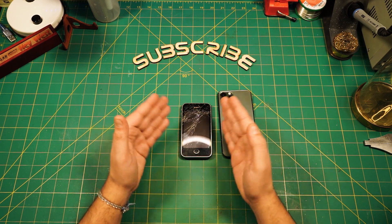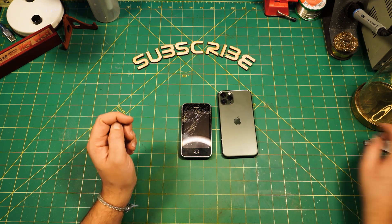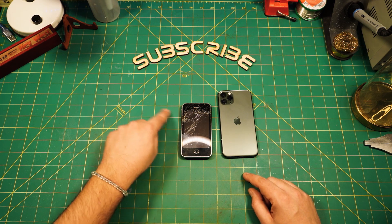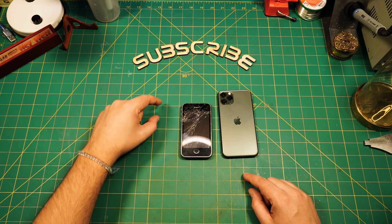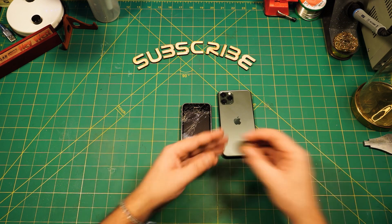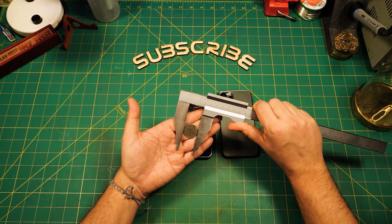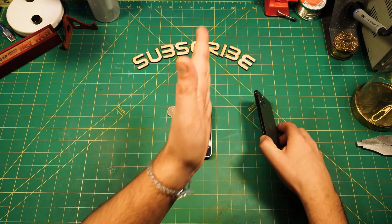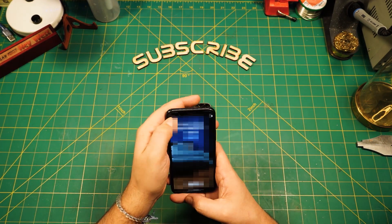The only thing you need is something to match the size in software. I have this mat here with inch squares, which is quite nice. You just draw an inch square in CorelDraw and scale up the picture to match. If you don't have something like this, I sometimes use a quarter — a quarter is around 24 millimeters — so I put that next to it when I take the picture. You need to take the picture straight from the top.